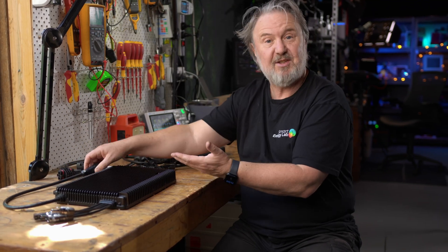It's totally plug and play. Here's a microinverter — this is their 2000VA big boy with four MPPTs. It has a maximum input voltage of 65 volts, an MPPT range of 16 to 60 volts, and an ISC of 25 amps per input, which is amazing. Their IMP is awesome too — they're at 14 amps.